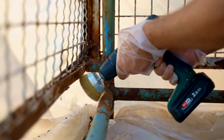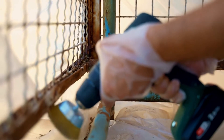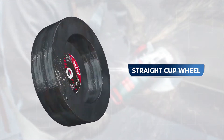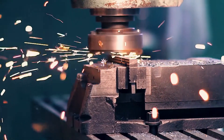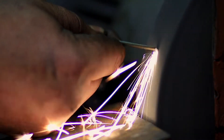If the grit is fine enough, the cup wheel can even perform delicate operations like paint and adhesive removal. The straight cup wheel is used as an alternative to cup wheels in cutters and tool grinders because it has an additional surface. Grinding with this type of wheel is most advantageous. The next one is the saucer grinding wheel, which is used to sharpen twist drills and milling cutters.